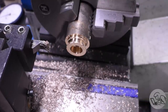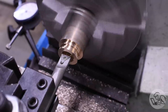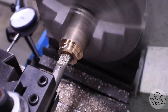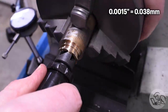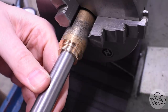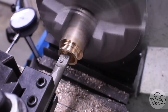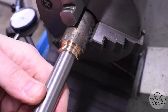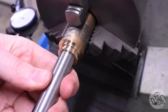It's going to be a plain bronze bushing with flanges at each end to retain it in the bearing castings. I drill that out as large as I can on this lathe and then bore it out to final dimension. I'm aiming for about a thou and a half larger than the crankshaft - just enough for some oil in there and a free-running fit. That is almost there; it won't quite go in, so I just did a final spring pass with the boring bar. A spring pass is just doing another pass with the same cross-slide value, and that takes any remaining deflection out of the boring bar or the part, and more often than not will enlarge it just that extra little bit that you needed. And now that's a perfect fit.